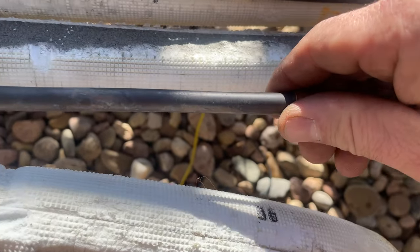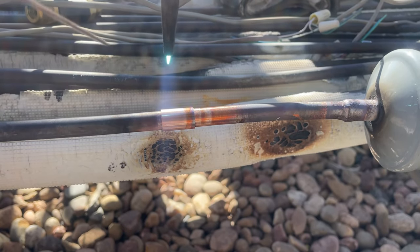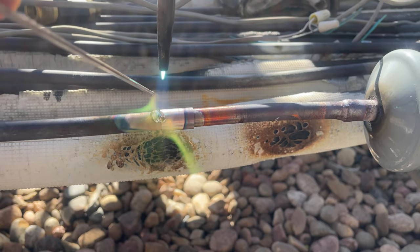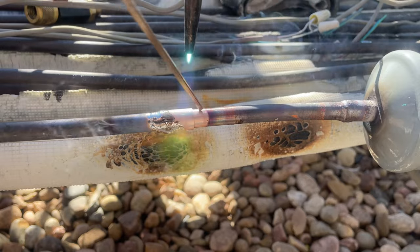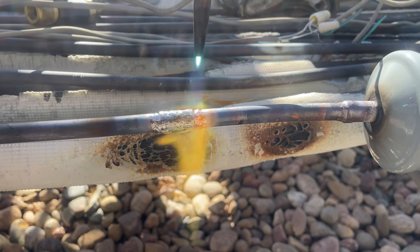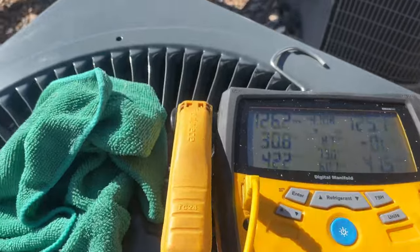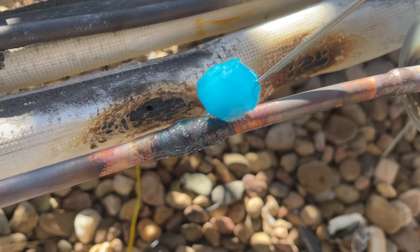I completely forgot a fitting. I'm an idiot. I've got this dialed in to 200 PSI, so I'll just let it rip — I don't hear any hissing. I'm going to hit all my joints with soap bubbles. All nine or ten of them, however many there were.